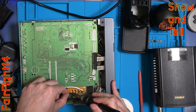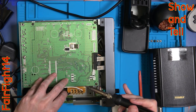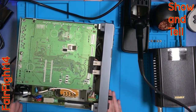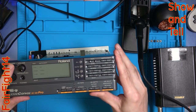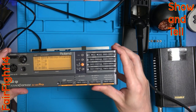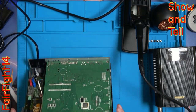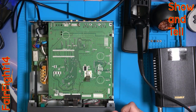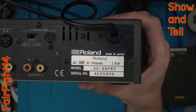Being really careful with the power arm — it's a long bit of plastic from the power button at the front which actually presses the true power button inside the case. You don't want to burn that with the side of your iron. Turn the soldering iron off, it's no longer needed. And now it's the moment of truth — making sure that I don't actually touch anything to do with the external power, because obviously I don't want 240 volts flying at my arm. Yay, it works! That's what I wanted to see. Let's just power it off and then power it back on again. Yeah, it definitely works — so that's really good. It's just a quick and easy modification, just a matter of getting the right tools. I also highly recommend changing the battery inside this so it doesn't rot through and ruin the circuit board. As always, happy gaming.